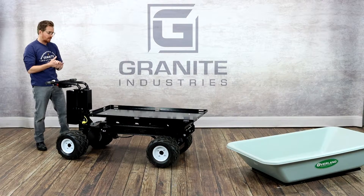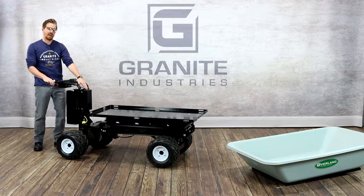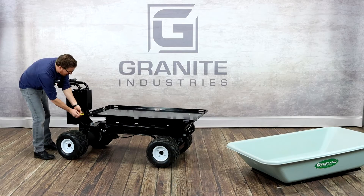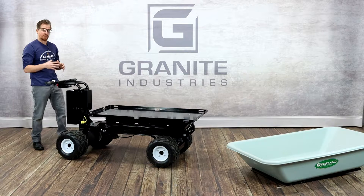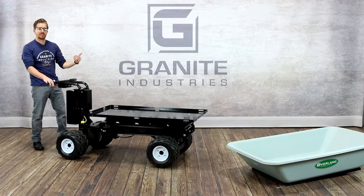Hopefully two to five years — it really depends on usability and how often you charge it. Not only is the battery pack very high quality, but the charger we put on all of our carts is also one of the best chargers you can get on the market. This is a five-amp smart charger, and you can charge it using your standard 110 outlet — just plug it in to an extension cord and into the wall. We recommend charging it overnight; about six to eight hours is what it takes. The smart charger charges the battery pack in three stages, optimizing both the speed of the charge and the life of the battery so you get as many cycles as possible.